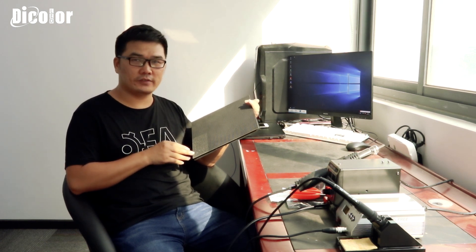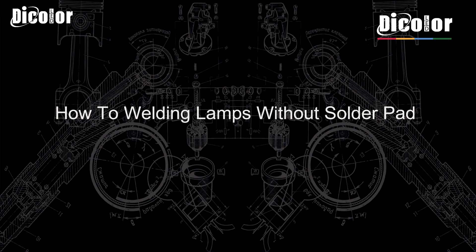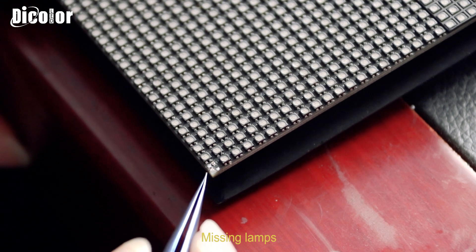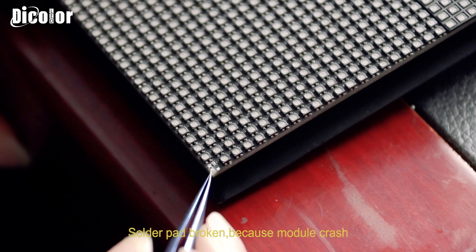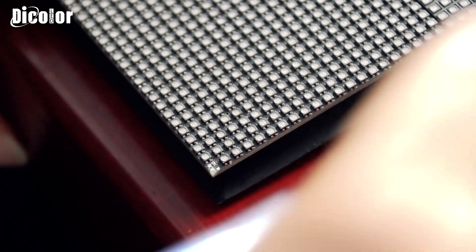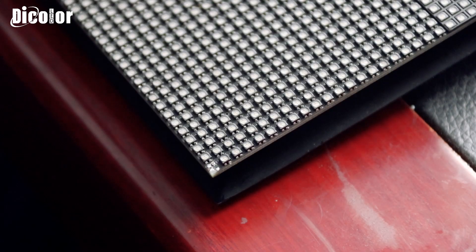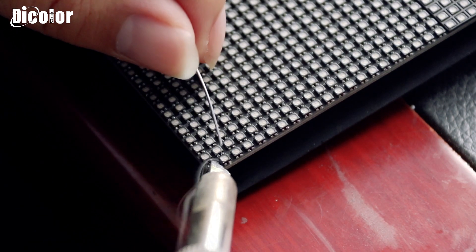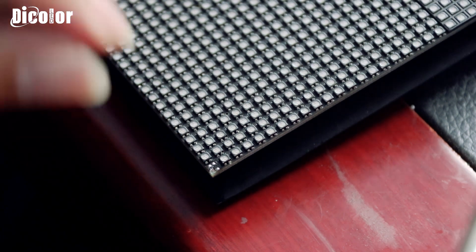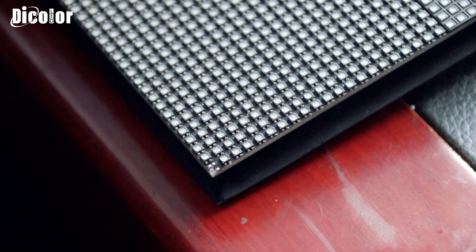Maybe you will see that it is very simple. But please follow me to watch this module closely. Right here we can see this knob is missing. And we can see the PCB pad is broken. These knobs have four parts, but one part is missing. We can try to add some tin using the solder, but one part is broken - so what do we do to solder the knobs on that side?